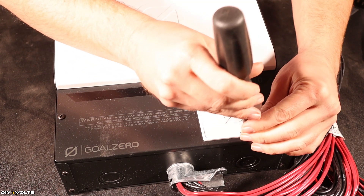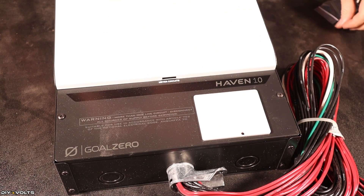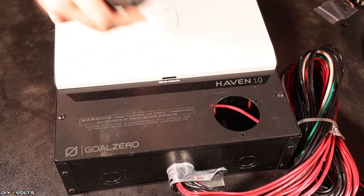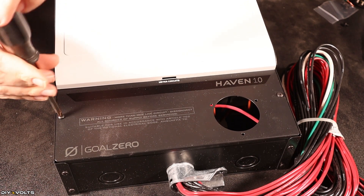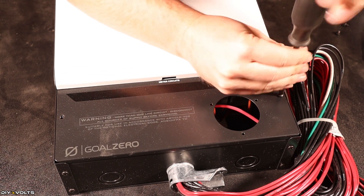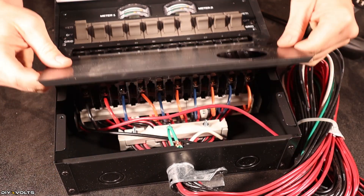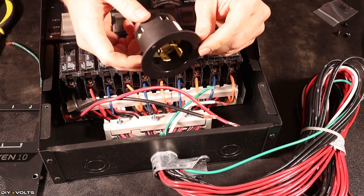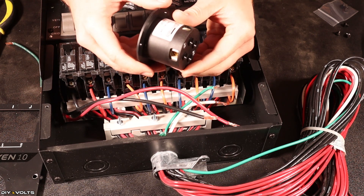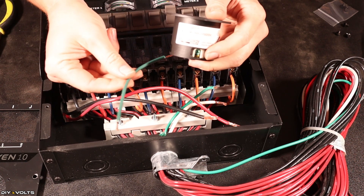Step one is to remove the cover for where the outlet plug is going to be, and also remove the case to access the inside for plug installation. I'm going to get these two screws undone on the side. Now we can lift up this panel and move it over to the side. This plug takes the incoming secondary power and has four different holes for wires — one is a green screw for ground, and this kit includes a pigtail for that.